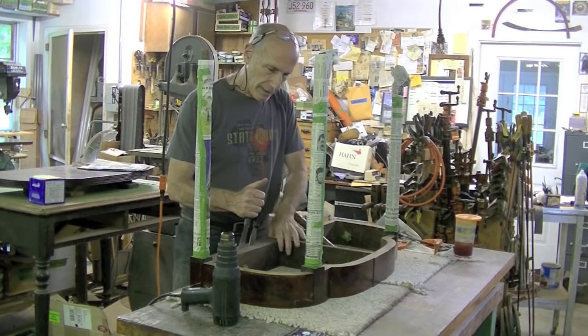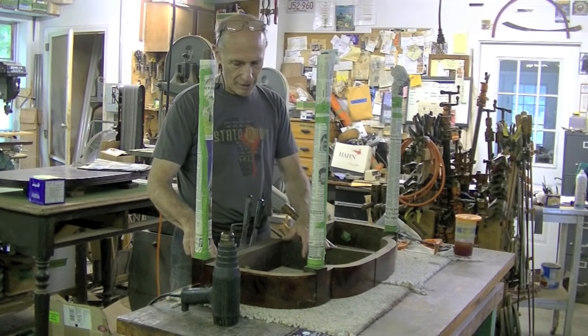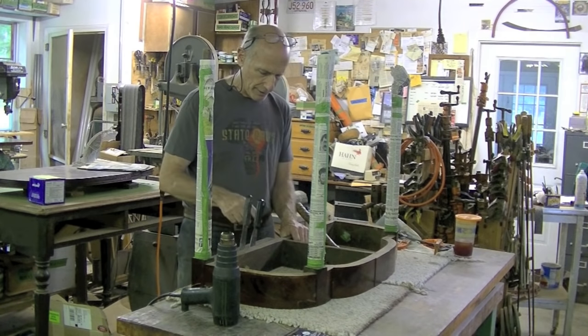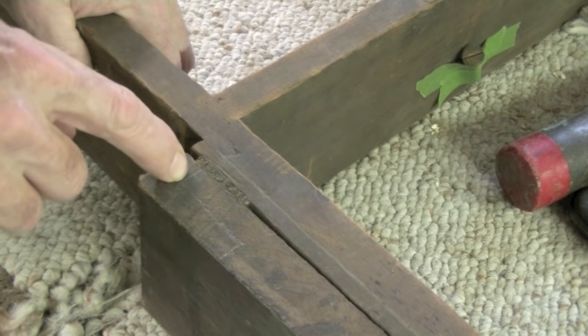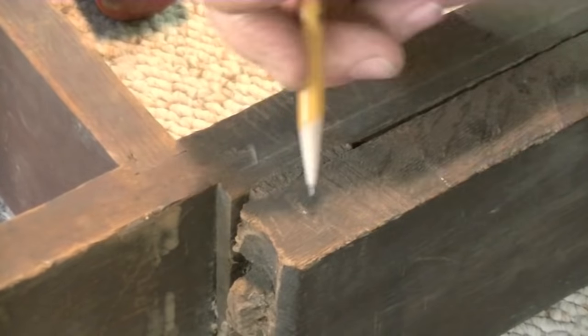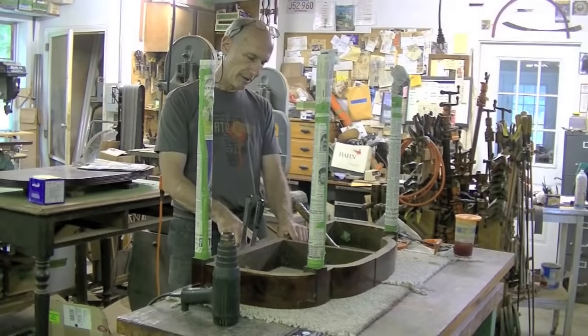It's becoming obvious that this piece is not going to come off of here very easily. But as I'm doing this and studying this, I realize that I'm going to cut this piece of wood and, with a half-lap joint, add new wood. And I can do that without removing it from the base.